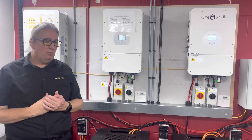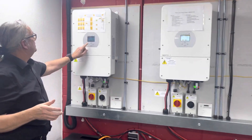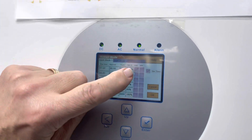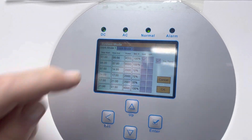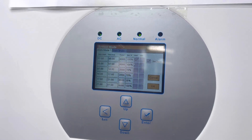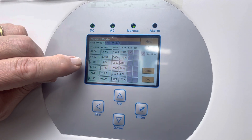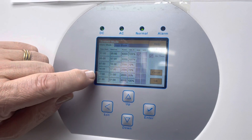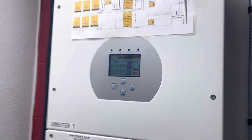The second part is they want to discharge the batteries at a certain time at night. To discharge the batteries we use the System Mode Controller. We've clicked Grid Charge from 1 o'clock till 5 o'clock, when electricity is slightly cheaper, so they can charge the batteries. During the daytime we've allowed the batteries to discharge to 70%, and after 5 o'clock they can discharge to 35% — that's additional power.